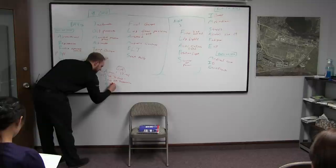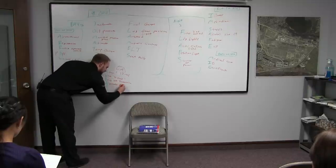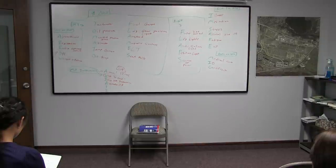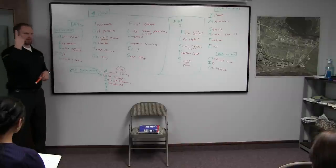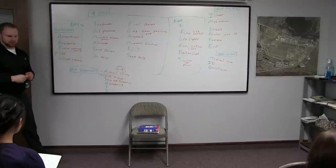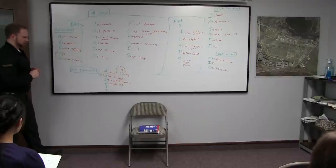Altimeter. And that's going to be every 24 months. So the altimeter pitot-static system gets checked every 24 months. They run the altimeter up to 20,000 feet and check it to make sure it's accurate with the system as they pressurize air into the pitot-static tube, to make sure it's reading correctly.